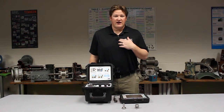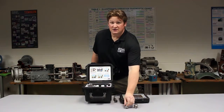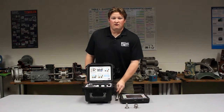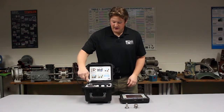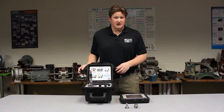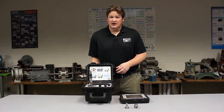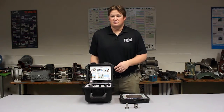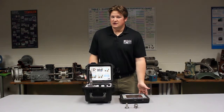And if you're like me or like a lot of analysts that I know, you have a variety of sensors at your disposal, so this is a good test to perform before you go out on the route. It's easy to do because the sensor can be magnetically mounted to the portable calibrator. It doesn't take much time and the calibrator can be scaled in both inches per second and G's. In this test we'll show you how to read on the CSI 2130 in inches per second.